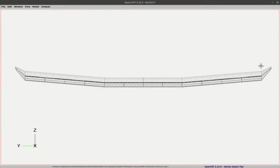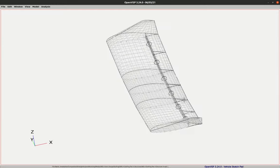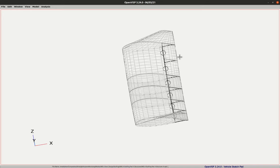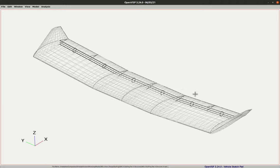From the center out to about here is the wing we've had all along, and I've added this little extra section. Here's the 30-degree dihedral — it's only about a foot and a half of extension. That does add just a little bit more weight. What I may do in the future is lop a few inches off and move it in so we have roughly the same surface area. The trailing edge lines up straight with the rest of the airplane, the leading edge is swept back, and we still have the same airfoil out on the tip. The ailerons still stop where they used to — they don't extend out onto the tip. I'm going to be pretty flexible on this wingtip; I may change to a Horner tip in the future.